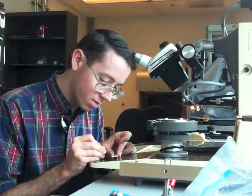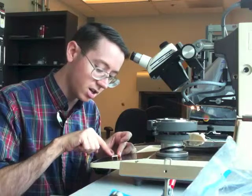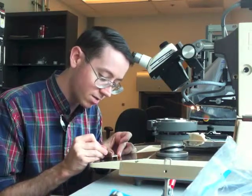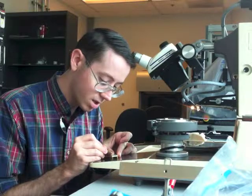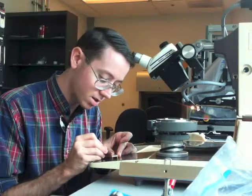I'm also marking using a motion like this on the edge there. That marks which pad I'm going to hit, because that way when I'm under the microscope, I don't have to count pads. I'm scratching back and forth on the pad to scuff it up and remove that corrosion.